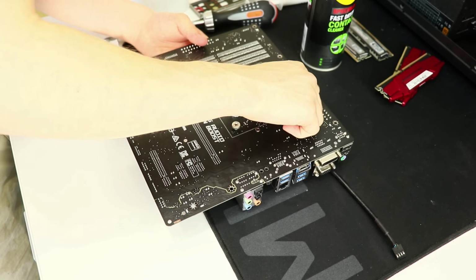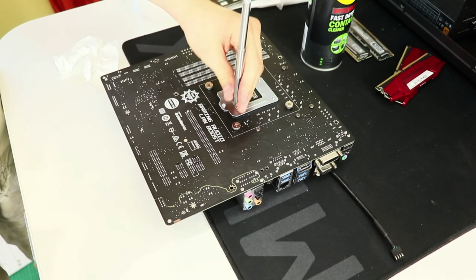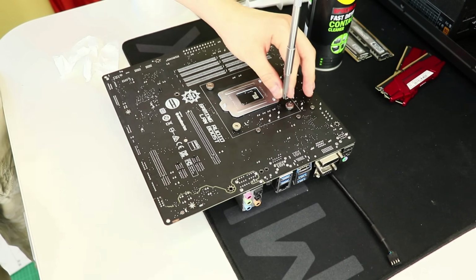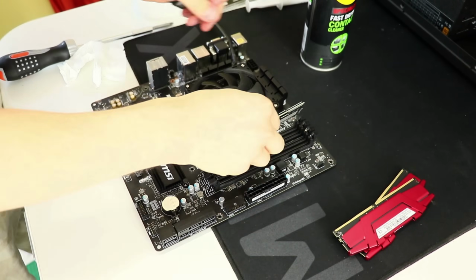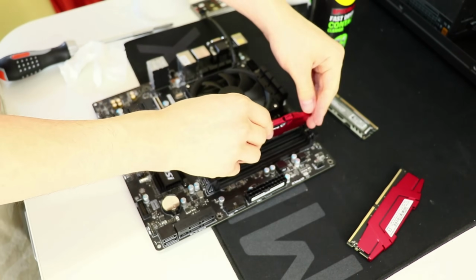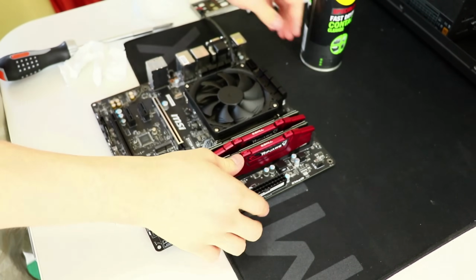But rest assured, all boards are set up as identically as possible, so we've locked the CPU to 1.2 volts and 4 GHz, but of course there are always operating fluctuations and tolerances to take into account. But this should be a decent way to compare many cases of many different sizes.